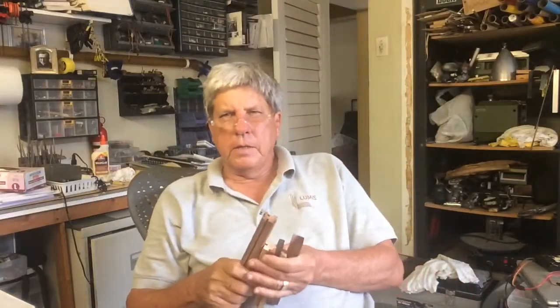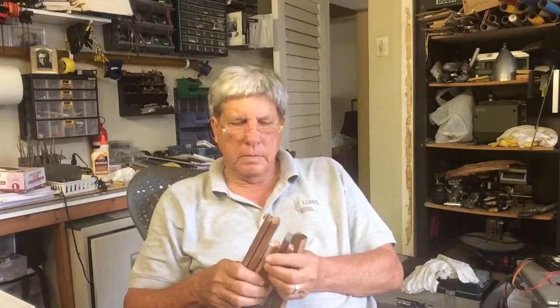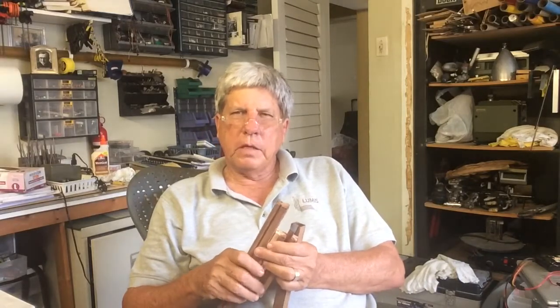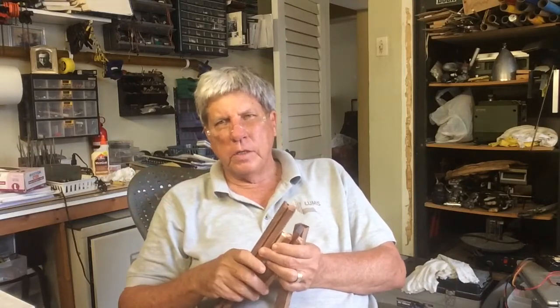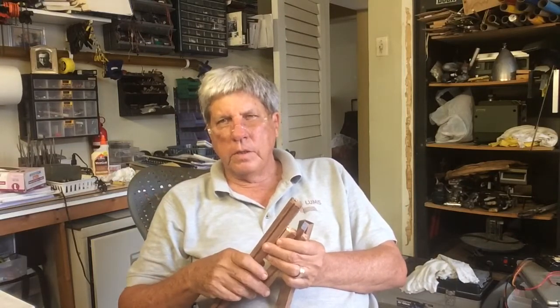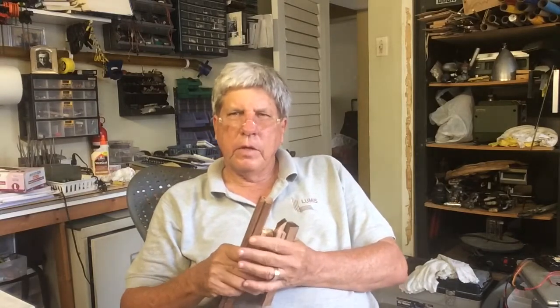And so I decided that I would use acrylic on the next case that I made, and I would make the case so that I could take it apart if a sheet cracked or needed to be changed, so that it was very easy to take the top or the bottom off and change that sheet. In the case of the first case that I built, if a pane breaks, unfortunately I have a major issue to replace that glass. I'll actually have to cut the top or the bottom off and slip the broken pane out and the new one in and then restick it.